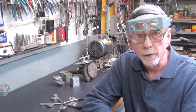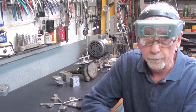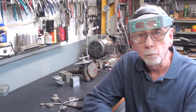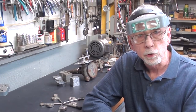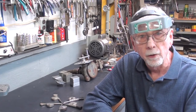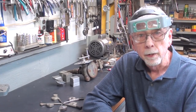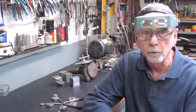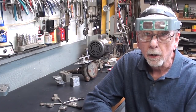This short clip was filmed some months after I did this three-part video. After I completed this video, I ran into a similar vise over at Lost Creek Machinery, and it is built correctly with a left-hand thread. I'm going to show you a brief clip of me at their shop in Ottawa, Illinois, actually manipulating their vise — I didn't buy it. It has a left-hand thread which allows you to turn it clockwise to close it. At the end of this video there'll be several still pictures showing the manufacturer. This is a six-inch wide vise, very well built, and it is for sale — not to be confused with the green one I'm working on.